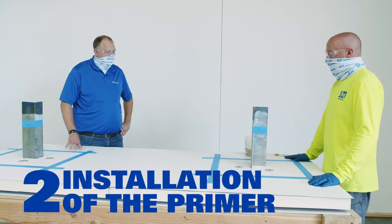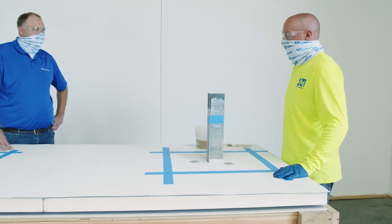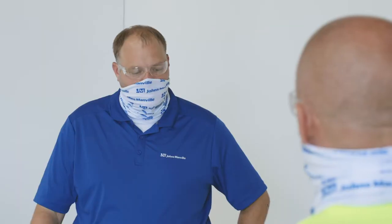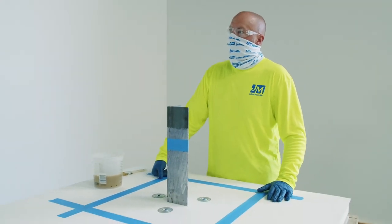We're back with step two of the installation of our single-ply liquid flashing. As you just saw in that breakout clip, we saw the mixing process associated with the metal primer. Just be really thorough — the portions in the bag are pre-proportioned. You pull that strip and then mix from side to side, making sure you work down into the corners, and just follow the two-minute mix protocol. I'll let you get started installing the metal primer — how much pot life do we typically have with this primer?